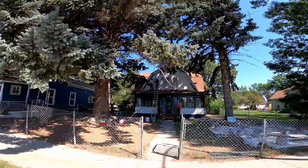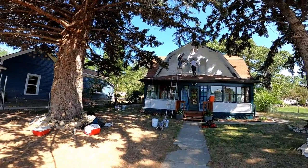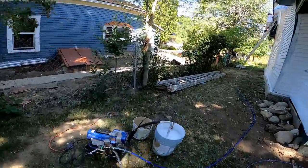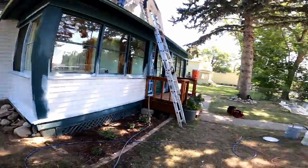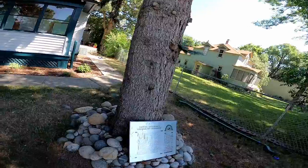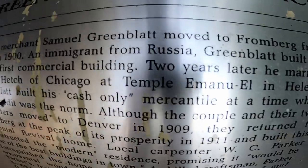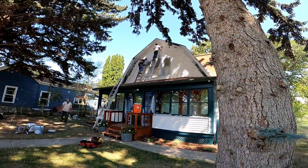Here's the house. We got two airlessers going. We're using 515 high efficiency airless tips and we are spraying on Peel Bond as the product we're using — Prime RX Peel Bonding Primer, a product from Sherwin-Williams. This house is extremely old, over 100 years old. Here's the historic plaque — this thing's been moved on several occasions. Look at that: 1909, originally built in 1900. Crazy — moved this whole thing several times.